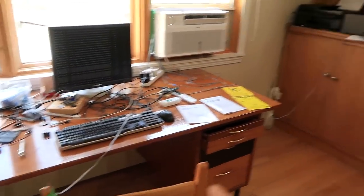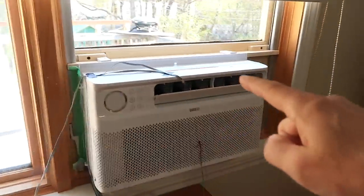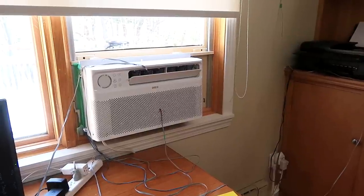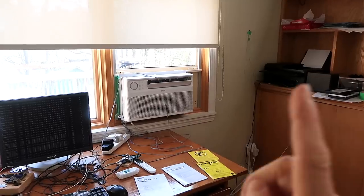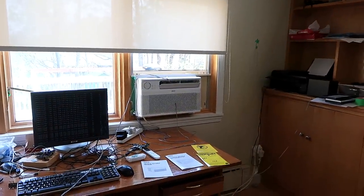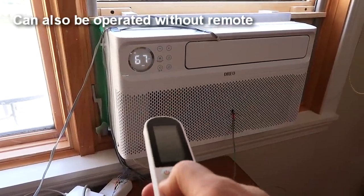I've got a whole lot of temperature sensors in here to measure the temperature of the room as well as the air in and out of the unit, plus some sensors on the back of it. The temperature right now is steady at 22 degrees or 72 Fahrenheit. I want to turn this thing on full and maintain temperature with space heaters — how much power that uses will tell me how much cooling this delivers. So I'll set it to as cool as it'll go.